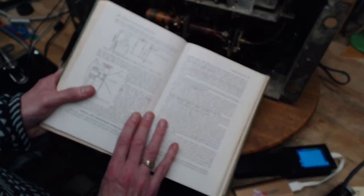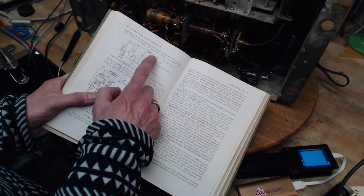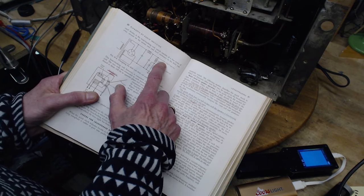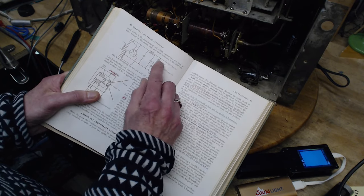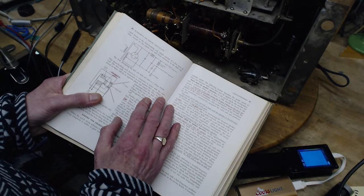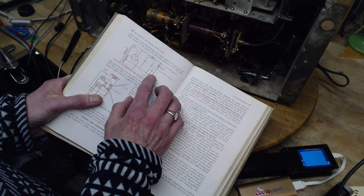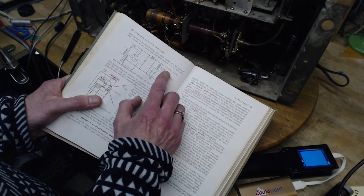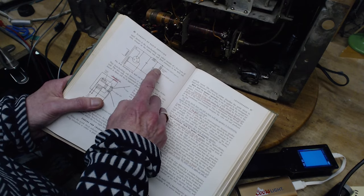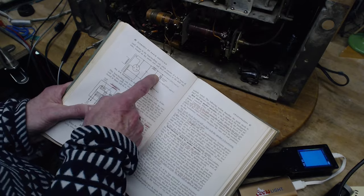And the last way here, this is an interesting thing that's going on here. So you have a power supply filter choke coil here, and the field coil is sitting here, and you're already on the filtered part of the B plus. It's already filtered, and you're sending some of the filtered B plus through the field coil. And what you're doing is you're using the field coil as a voltage dropping resistor in a resistor series to give you differing voltages here that you might want. You might want this 300 volts going to the output tube, and you might want the 200 going to other tubes, rather than put a resistor here, which could be done. Field coil sitting there, and you get the double bang for your buck.